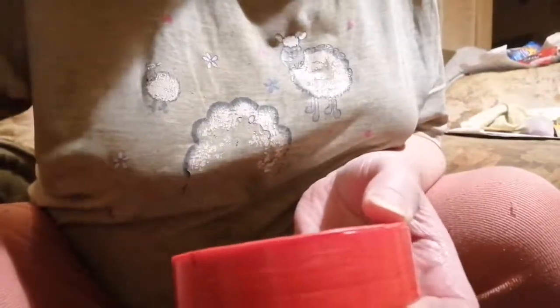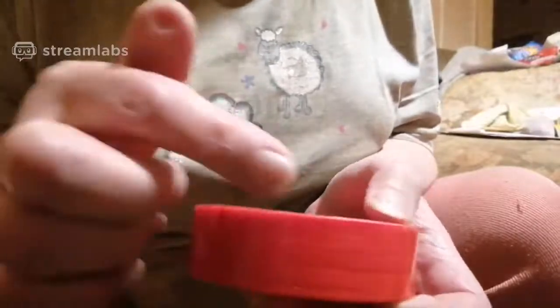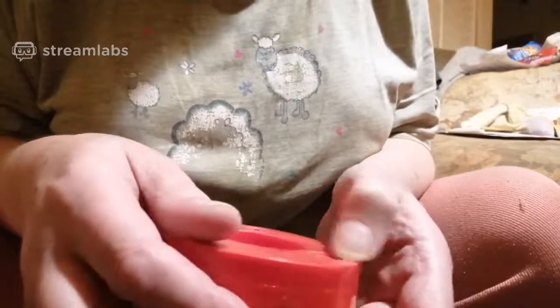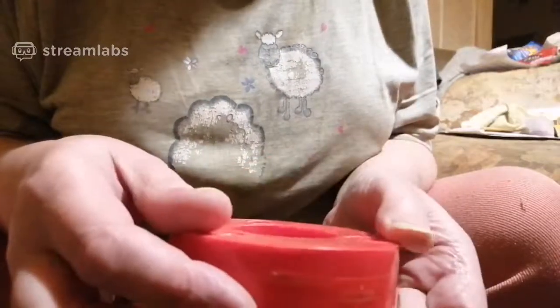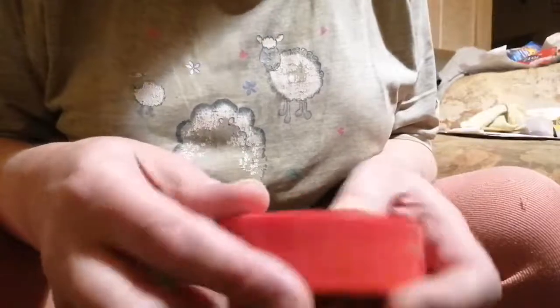Right. So what I'm going to do is, I've got some improvements to make on the frame that holds everything, the top and the bottom stators that hold this thing in place. I want to add a rib to the arms to stiffen them up a bit. I have not printed them yet. I thought they're probably going to be a little bit flexy, because they're only about 2.5mm thick, so they are going to bend a bit.